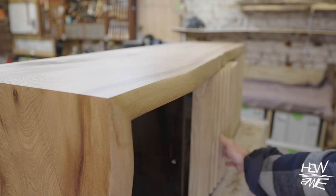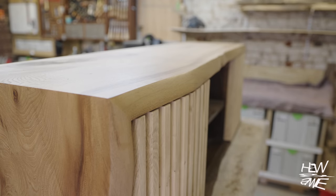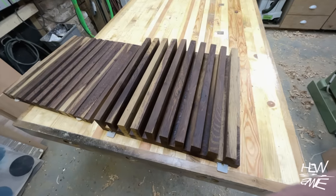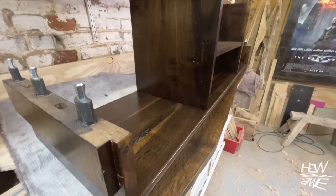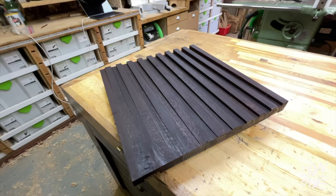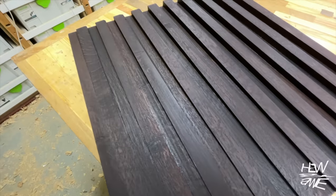Now remember, this is a TV stand, and the star of the show is the top board, not the oak doors. And that's what happens when you mix up your woods and you're trying to age it using ammonia and tannic acid. So I tried to save the day by staining and trying to match that same colour and depth, which was just impossible. It just came out a flat, dark chocolate. I mean, you could barely even see any wood grain in that, so that pissed me off.